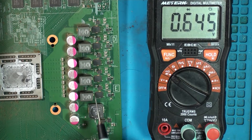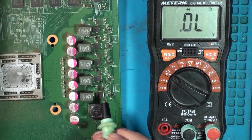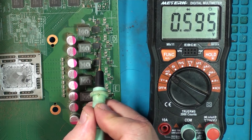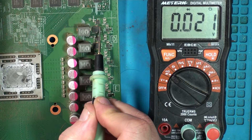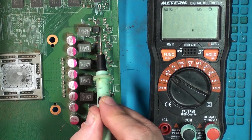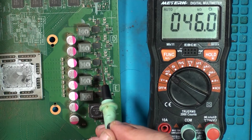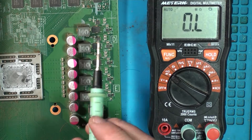They're all good. Now let's try the bigger ones — 0.594, fine; 0.594, fine; same again, fine. I could be in trouble here, might not be these. Oh no — 0.02 on the diode reading, so we found one, it's gone. 12 ohms on that one versus 46 on the others — it's shorted. I believe this is an easy one and hopefully that's the mosfet that's gone.